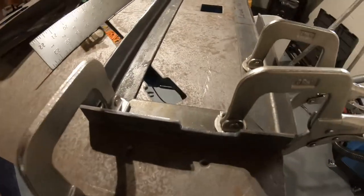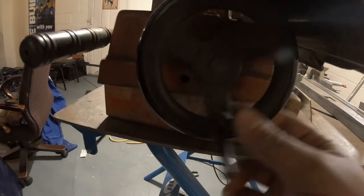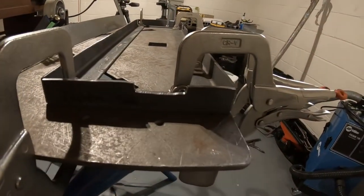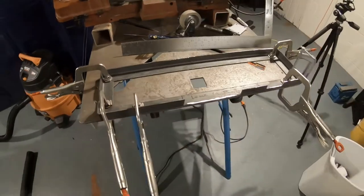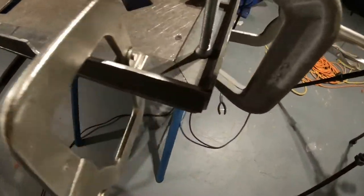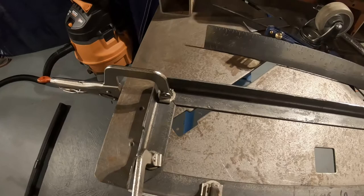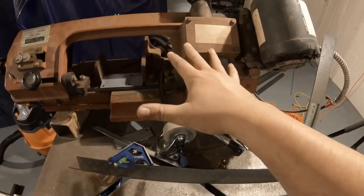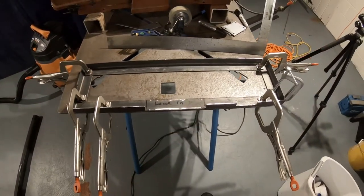And I did the same on the front over here, because the spindle to loosen and tighten the clamp is right there, and that was going to interfere with that. So I had to do a little bit more work than I thought I was going to get this done. But you can see we 45'd all these cuts. Nice, good fit up, so I'm going to do outside corners on these and then weld from the backside after that, so that this sits in there flush without wiggling around from the welds being on top here. So let's go ahead and get going with that.